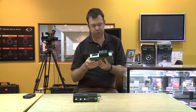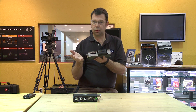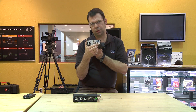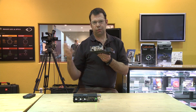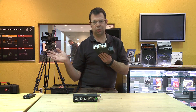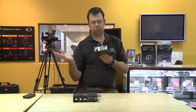As far as powering this machine goes, you can use a 7.2-volt camcorder battery, but the more likely scenario is the 4-pin Hirose connector which allows DC input. You could have one battery powering everything in your kit, and with two rechargeable batteries you're good to go — these things will last for almost two days on a rechargeable battery.